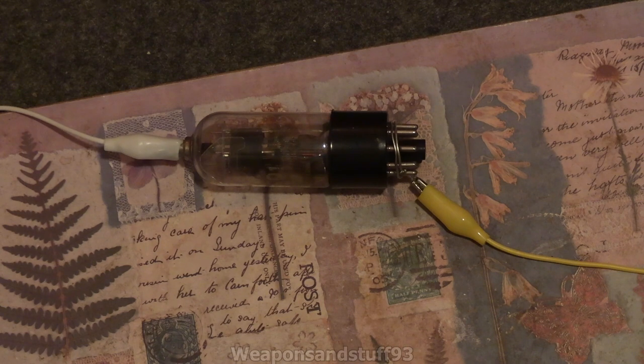If you do this at home, be very, very careful. I basically bought one of the Chinese high-voltage step-up devices designed to supply neon tubes, which require very high voltage, and I'm just running it through that — at least that doesn't burn out. A lot of cheaper high-voltage things tend to burn out quite quickly doing this. Your tubes might also burn out. There are physics forums online where people discuss which old vacuum tubes are best for making x-rays, as some old rectifier tubes are better than others. Personally, I don't really want to make scary levels of x-rays — I'm just interested in demonstrating how it works.